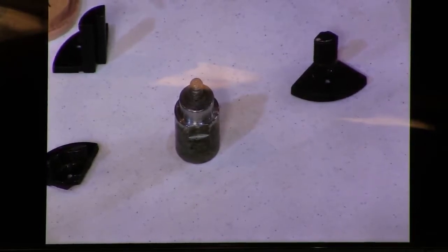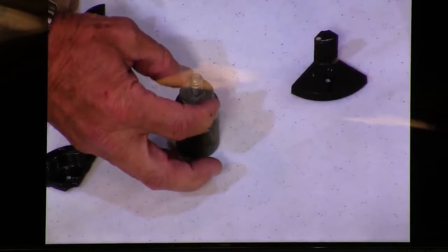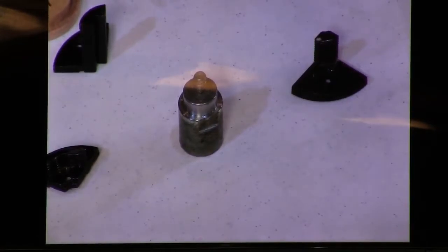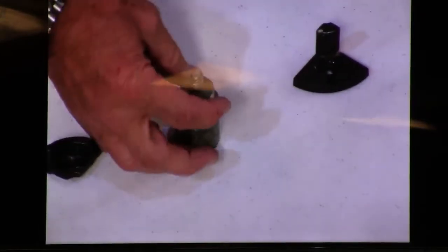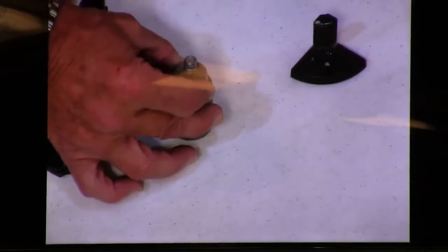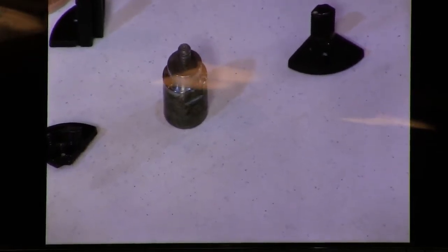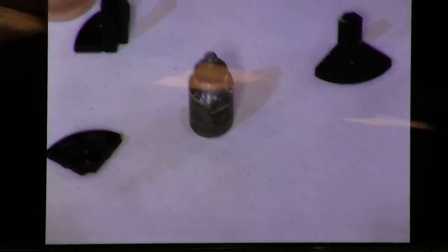The chuck for bottle stoppers — it's not my real favorite because every manufacturer of bottle stopper attachments uses a different diameter. So if you base your wood turning on this diameter, it may not fit — it may be bigger or smaller than the piece you're turning. So it's not my favorite. I usually put a caliper on the edge and then turn it to that dimension.